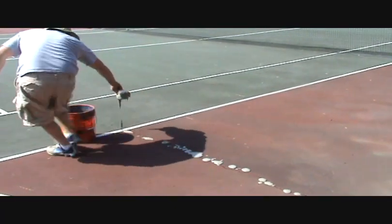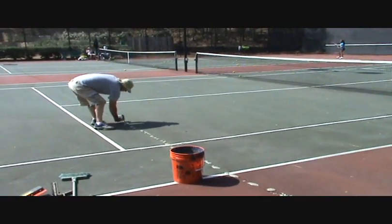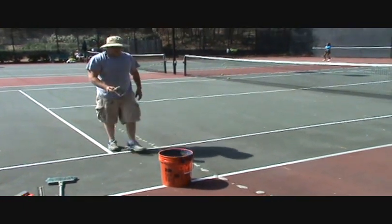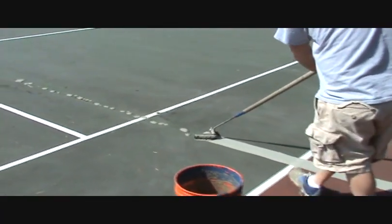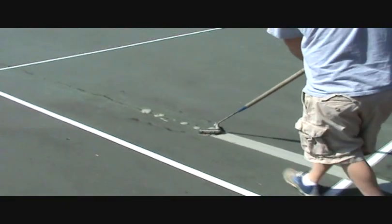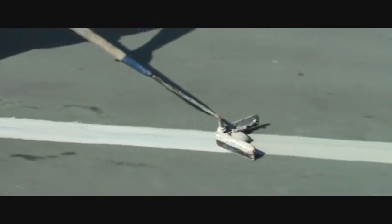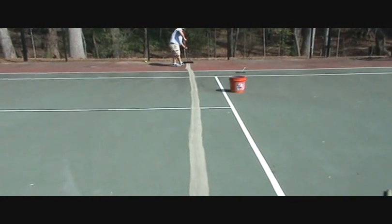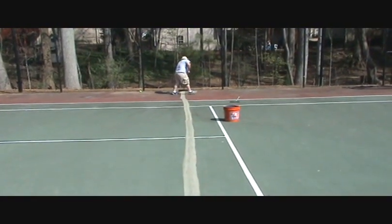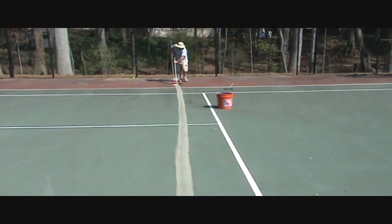Once the work area has been cleaned, fill your crack with latex cement patching compound using your normal crack filling techniques. We're using a handy little V-shaped squeegee to fill this fairly narrow crack, but you can use whatever you're comfortable with, a trowel, a flexible knife, even a flat squeegee. Whatever you normally fill cracks with will work just fine, as long as when you're finished, your crack is scraped smooth to the surface and there are no edges on your patch.